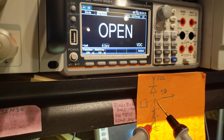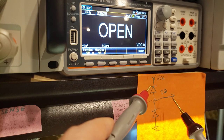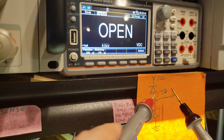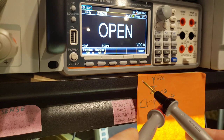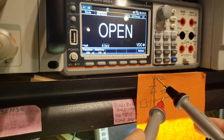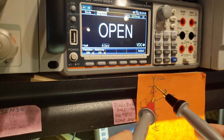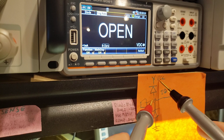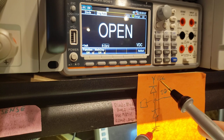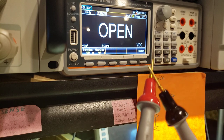Using this method, we can test for two conditions: one is when the pin is not soldered well, and the other is when there's a short. You can essentially do the same thing with VCC — in that case you'd place the ground probe on VCC and the red probe on your pin — but you need to know which supply to probe since there might be multiple supplies on your circuit. That's why you usually see people testing against ground.